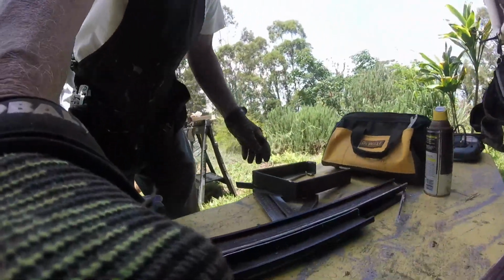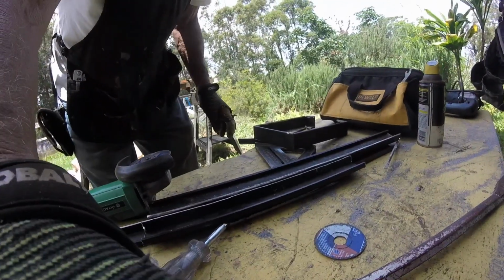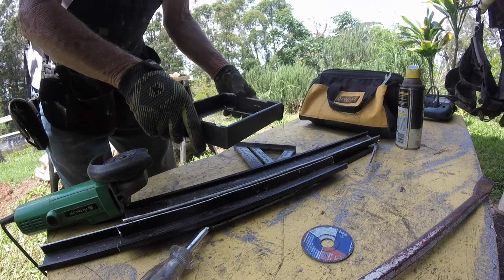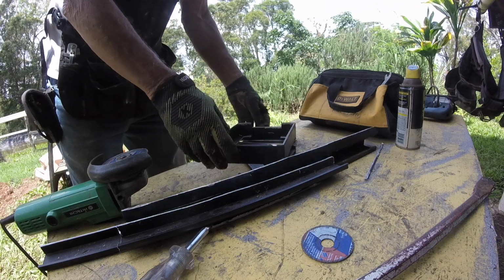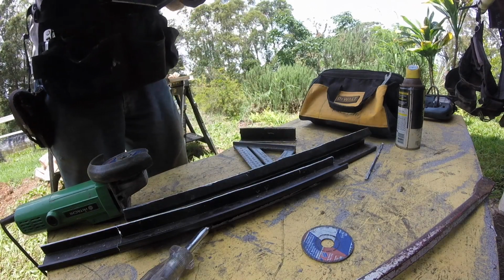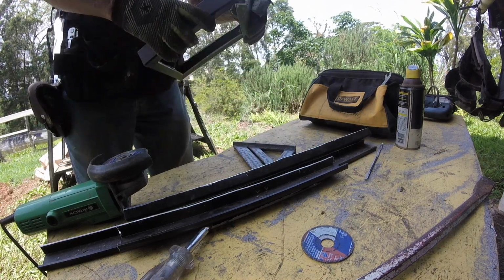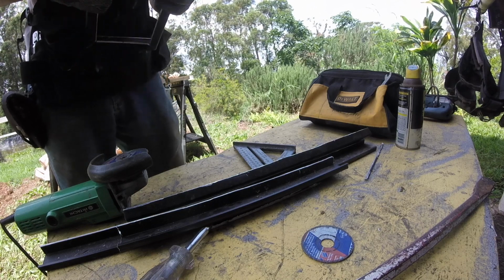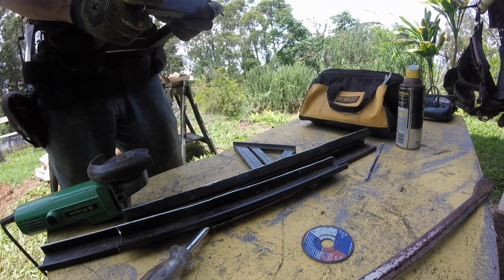Okay, so we're going to move you back over here. What I got to do, I'll show you what I'm kind of doing. You guys are right in the aluminum bits. So this piece will go on here, just like that. And then that makes my tray. So now what I have to do is drill and pop rivet this thing together.